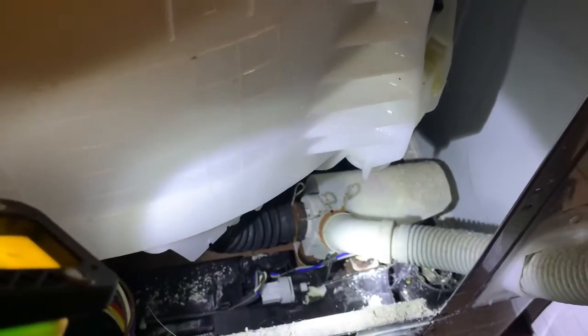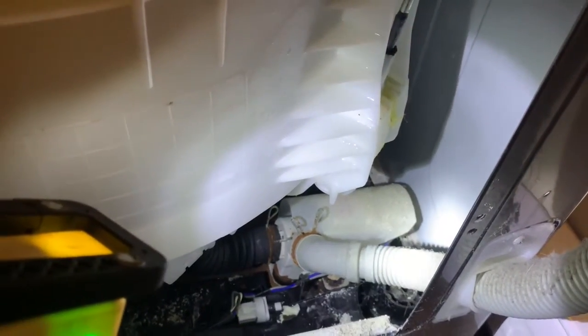What I saw was a lot of moisture at the bottom. Like most leak diagnoses — whether it's in your car or your house — start at the bottom and keep working up, following the moisture to see where it's coming from. I followed it all the way to the top. You can see there's a hole here — I'll try to point to it — and that hole is essentially an overflow drain where excess water can drain from.